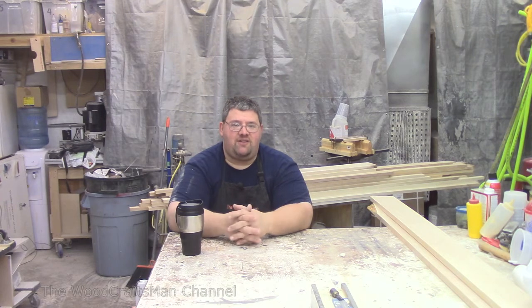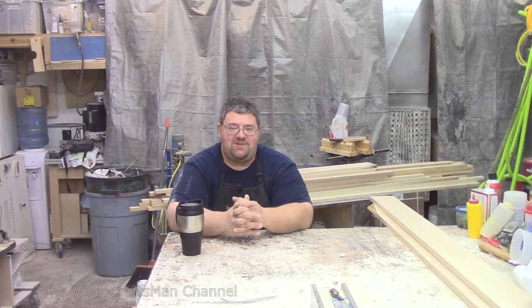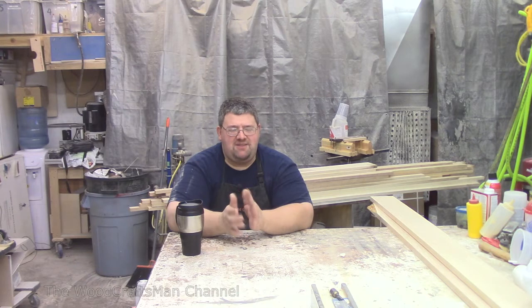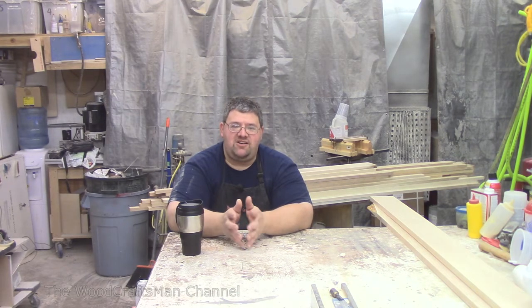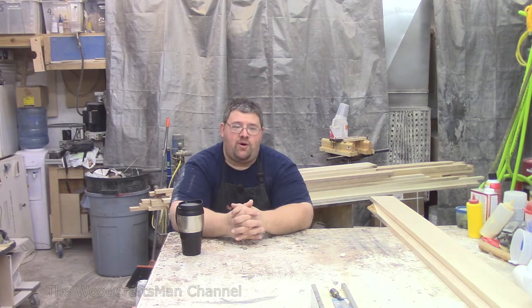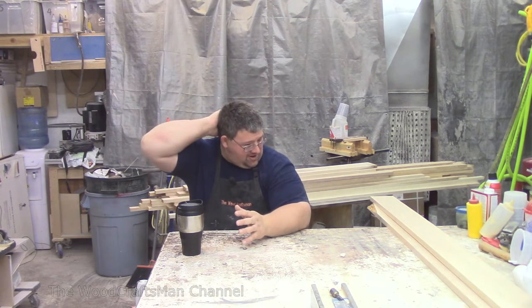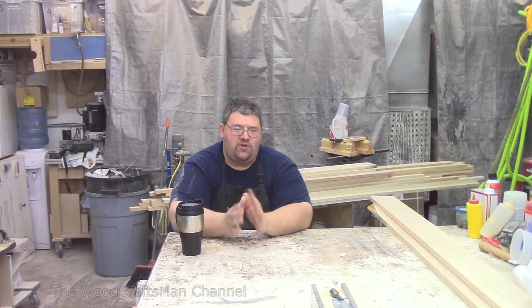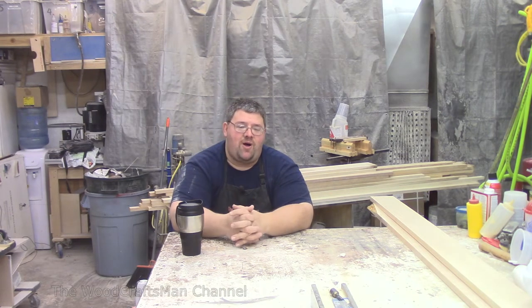I've looked at the specs and it's got a very wide range of RPM, CFM, static pressure and horsepower to be able to do a lot of different things with it. So in 2018, probably 2019, I'm going to be adding a lean-to addition onto the back side of the shop, and putting in that blower with a new filter bag setup as well. It'll give me a little bit more space in the shop too, which would be a nice thing. I'll show here at the end some proposed layouts for when this project happens, but I really want to talk more about things leading to it as well.